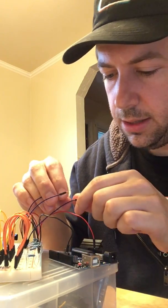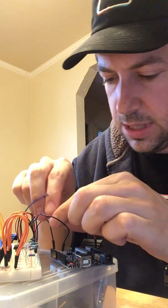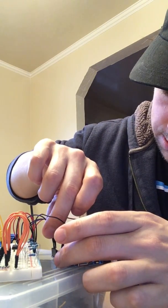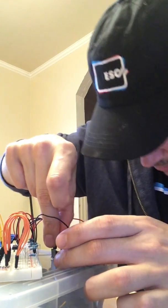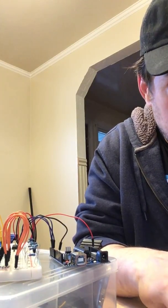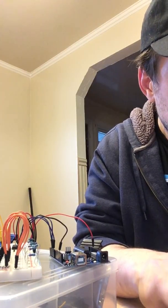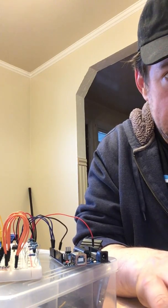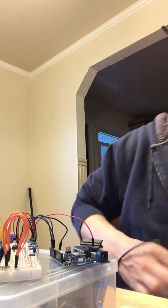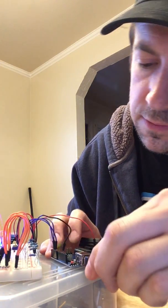So let's make sure I do that correctly, because with the data, one cable in the wrong spot, as you have experienced, I'm sure, nothing works because the data gets all scrambled. So 4, 5, and 6. Cool. So now all of my wiring there is complete, and let me just make sure that my Arduino program is correct. Nope. So in Arduino they're called sketches. So the 8 LEDs in the shift register sketch is the one I just loaded up here. And I'm going to hook in my power, which is a USB, and it also is my data. And so there we go.